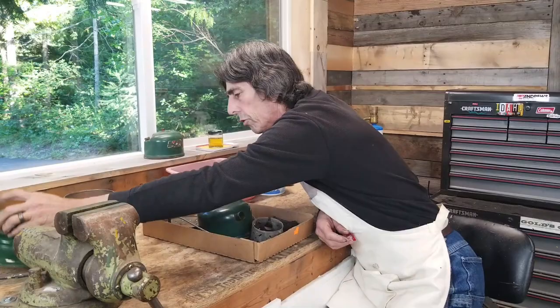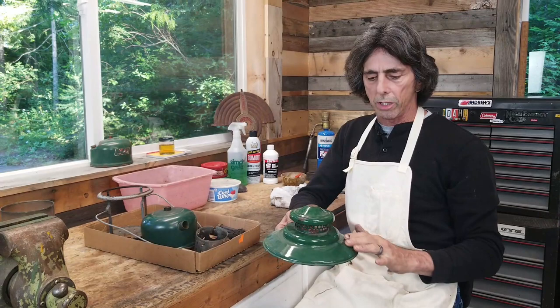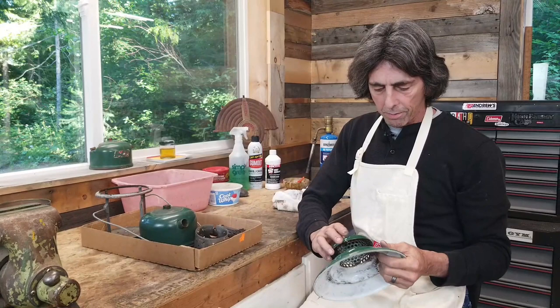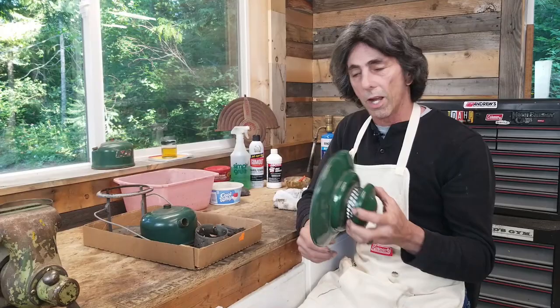The first thing I'm going to take out is the ventilator and the globe, because those are both going to be cleaned in the kitchen sink with warm water and a soft sponge. You don't want to use any abrasive or harsh cleaners on your ventilator. This one has seen better days, but if you used a scrubber it would ruin the shine. You cannot paint one of these - this is porcelain enamel, don't try to paint one. Just wash it in warm water and it will look nice.